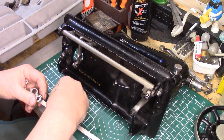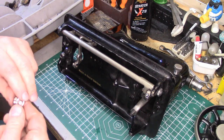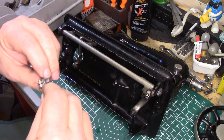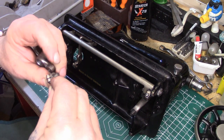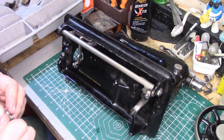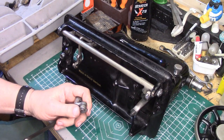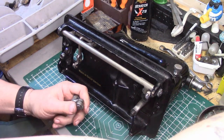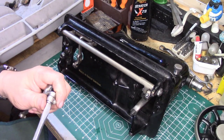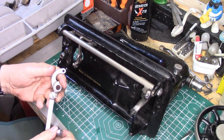Flipping that over so I know it's going to be right and putting the bolt in. I know it's the correct bolt because it's a shoulder bolt — when you put it through it's just about a thou or so proud of the bottom end of the connecting rod. The more of these you do, you'll be able to pick it out just by sight. I get that snug, not messing with those screw adjustments.